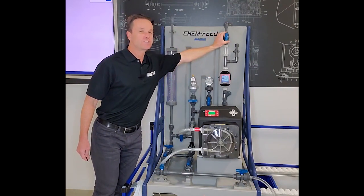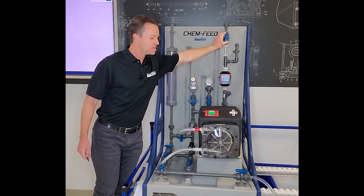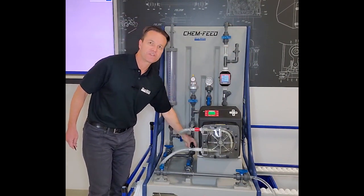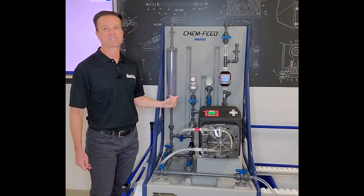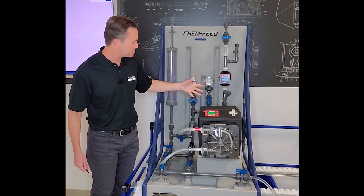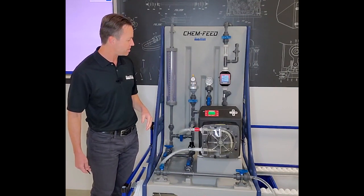What I'm going to do is introduce back pressure by closing the discharge valve right up here, and then I'm going to quickly shut down the pump so we don't build up too much back pressure. We do have a pressure relief valve installed, set to a cracking pressure of 27 psi. Right now I can see that our pressure is at about 30 psi and it looks like it's going to hold around there.